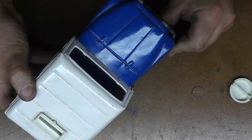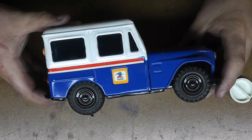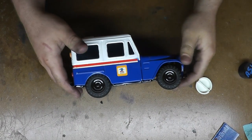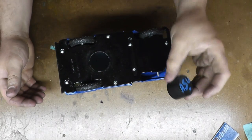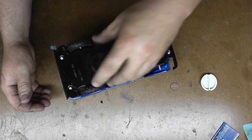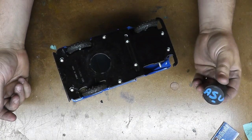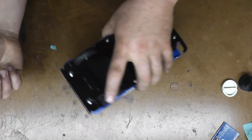So any change and everything I get is going in this guy, and in 20 years we'll have enough to buy a milling machine. So that's what we have to make, we have to replicate this. Now, I wanted to use the Delrin that I have, which is 1 3/8 inch, but that is the exact same size as that hole, so that's kind of out. But I do have 1.5 inch aluminum, so I'm going to end up making it out of that. And another little project I need to take on